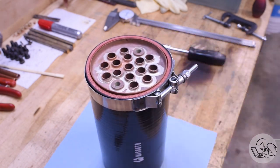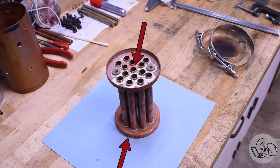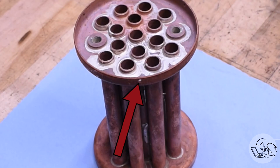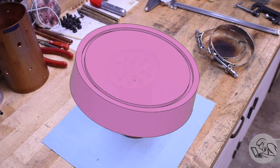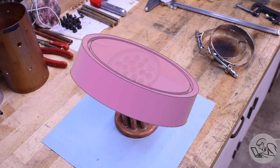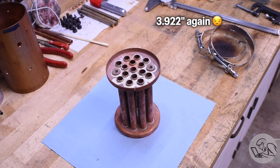The next idea actually came from one of my patrons, Tanda Madison — you should follow her on Instagram because she's awesome. She suggested pressure testing this thing inside out: just cap the ends and pressure test the inside, because the ends are much easier to cap. My first thought was to use an o-ring, but there's a problem — those stud holes are very close to the tops of the flanges. An o-ring needs a land, but it would be half covering the bolt holes, and I also couldn't find an o-ring the right size. So I think I need to use some kind of flat gasket instead.